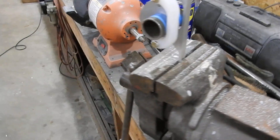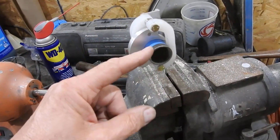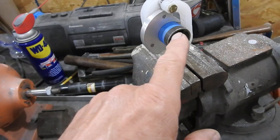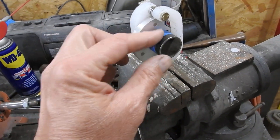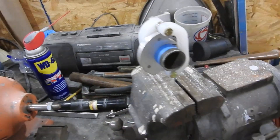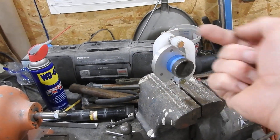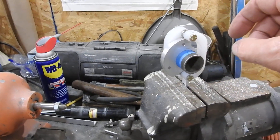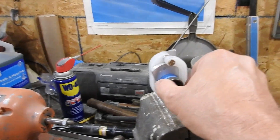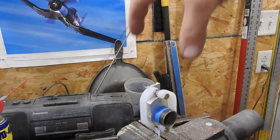I've got a short piece of tube in here — this one was already fitted to the torque tube. Now remember the landing gear is powder coated, so it's a little thicker than the tube. This is inch-and-an-eighth tubing, same thing that's in the plane. So I put a little tape on there to make the difference, because this has already been fitted to the torque tube and it goes in tight. There's an arm on the torque tube — the hydraulic linkage pulls this thing back and forth. This would be as if the gear is in the full down position.